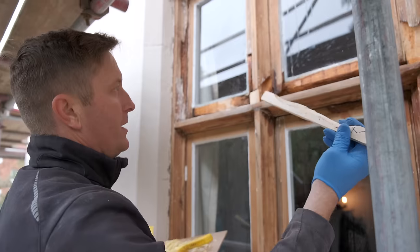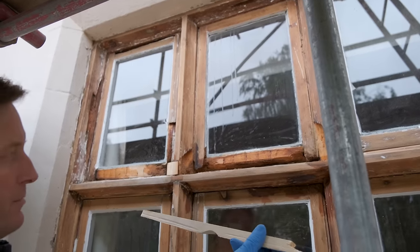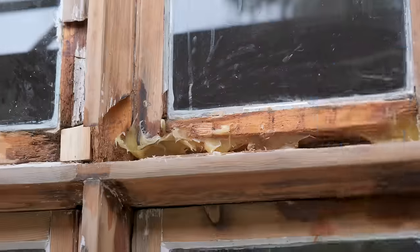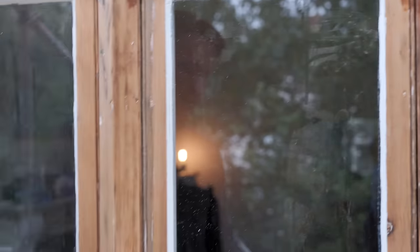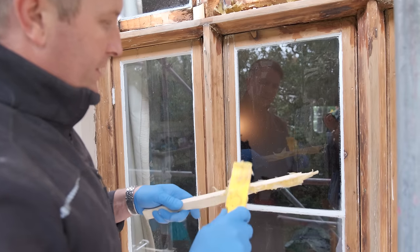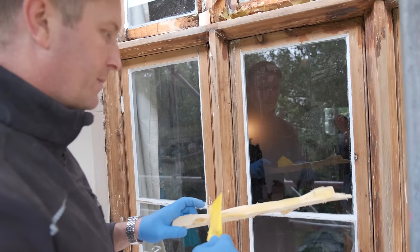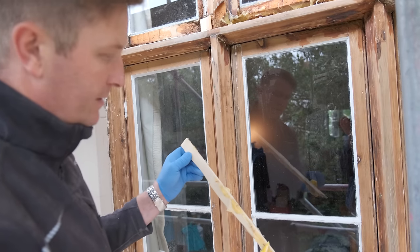So that's mixed. All I'm going to do is get some in the key areas that I want underneath there, in there and in there, and then this piece will get buttered and pushed in. Then we'll fill all the gaps. As you can see, the tube doesn't go far at all. Although I'm trying to fill every void, it's not the end of the world if it doesn't — but it is the end of the world if you haven't covered and made a seal everywhere, because the smaller the hole the worse it will be. You get a capillary reaction and it will just draw the water in twice as fast as what caused this mess in the first place.